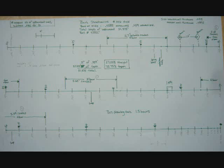By measuring the wall thickness of the tubing at the tuning slide, I found it to be 17.5 thousandths of an inch, or 0.0175. Along the green center line, I would measure the outside diameter and subtract 35 thousandths of an inch to get the inside diameter, or bore. I did this for the entire length of the instrument and found that 27.25% of the instrument was made of straight tubing and the other 72.75% is made of cone-shaped tubing. This ratio is what determines the exact pitches of the notes that can be played on it.